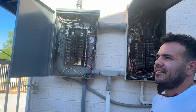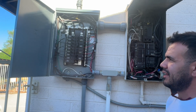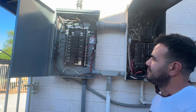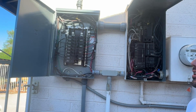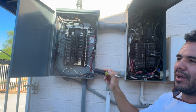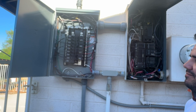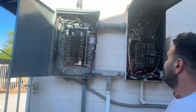That's something I was hoping for with this channel — that people could add on and mention how they do it in their system, because there are so many ways to go about solar. It's not just one way. Rich brought that up, and now everyone can understand that's a much faster way to get your house back online if your inverter fails. Obviously the 100-amp transfer switch is still the best option since you're back online instantly, but if you've already installed the system and don't have a transfer switch, this quick fix works great.